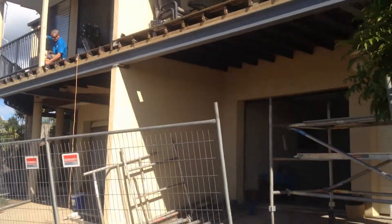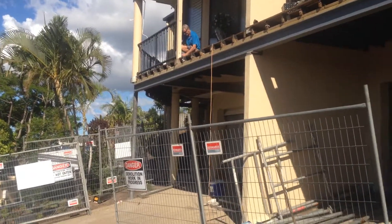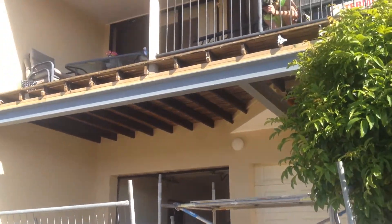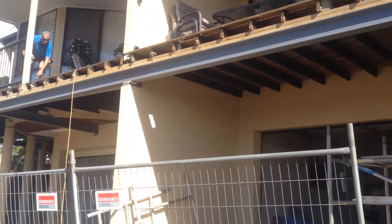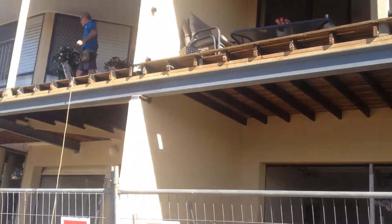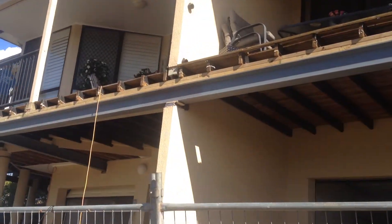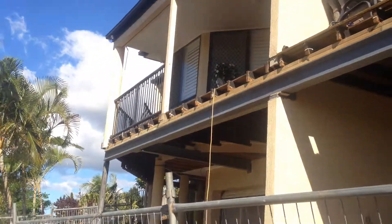You can see this is where we came with the crane and the steel guys last Friday. What we've had to do is put the steel with these timber packers on top of the steel there. These packers are down permanently, but the deck's back down temporarily just for the quick Easter break. We're going to lift it back up and put a flashing over the top of the timber and down over this so no water can leak into the steel beam and ruin all the work we've done.